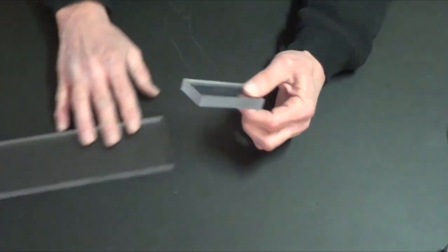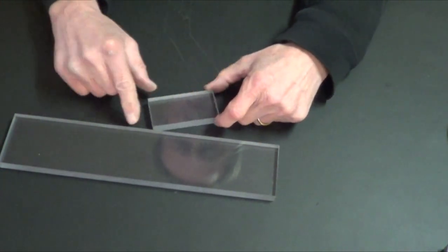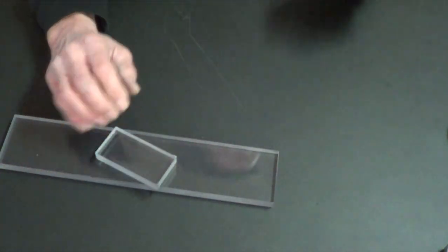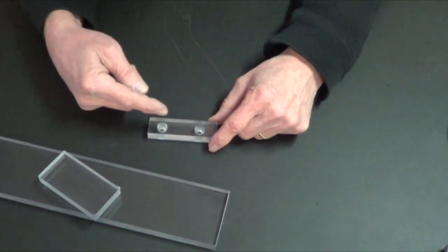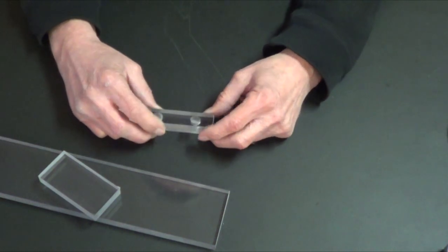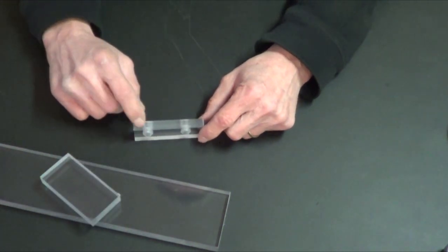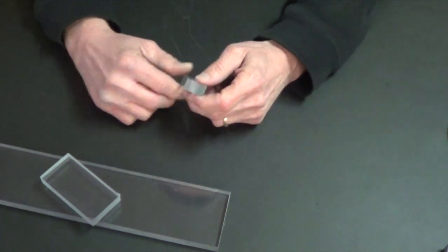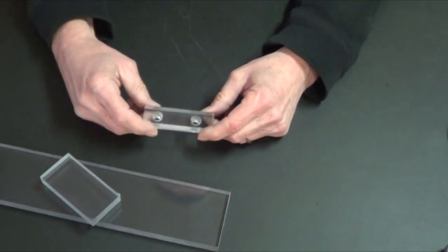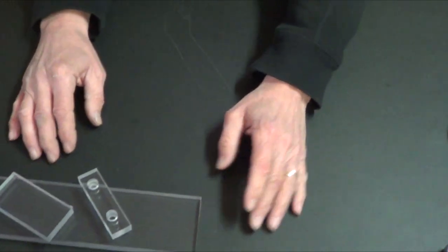I also have a taller set that I can put in the vise and use as soft jaws — it works. I've also been making a set from acrylic for the mill vise. I run the acrylic on the granite surface and it's absolutely flat — perfect. I started making a set and blew the first one because I forgot to account for the edge finder offset. But I love machining this stuff — the acrylic is really beautiful, and the dial indicator on the granite block confirms my tram is really good on the mill.